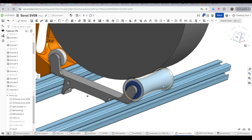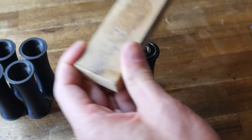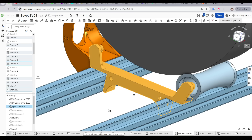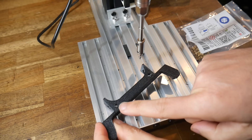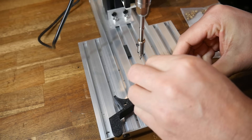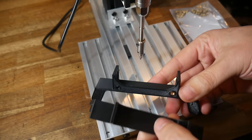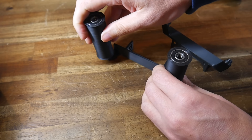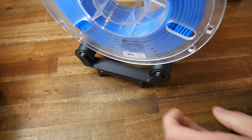The first printed components are the rollers — you'll need a pair per toolhead, and each end gets a 608 bearing hammered into place. These are a pretty firm fit, but the tolerance should be right so the part doesn't break as the bearing is forced in. The next component is the span bracket — you'll need a pair per toolhead. On the flat side there are two holes, one larger than the other, and that larger hole receives a single M3 Voron-spec threaded insert, melted in flush with the surface. These parts are designed so when placed back to back, there's a threaded insert on each side to bolt them together. The parts simply press fit together to form a sub-assembly that can hold a spool, and all the ones tested fit and roll nicely.